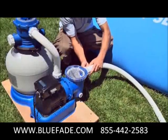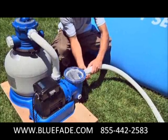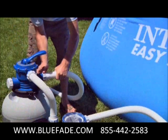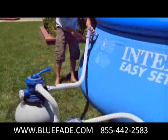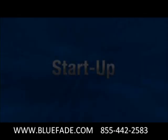Connect the lower hose to the pump motor, making sure that the O-ring is in place on the pre-filter inlet. Connect the upper hose to the 6-way valve outlet. Secure all connections. You are now ready to fill the pool.